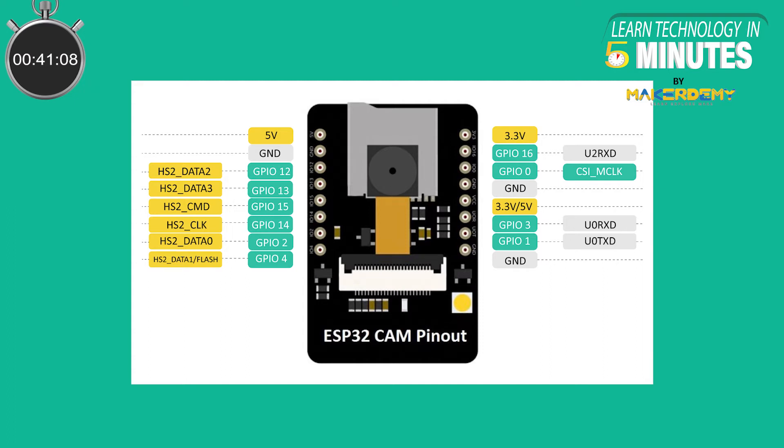Now let's examine the ESP32 Cam board. First, let's take a look at the side of the ESP32 Cam which has the camera module. If you have already had experience with other ESP32 boards, the first thing that will stick out about this module is the fewer I/O pins. To be precise, we only have access to 10 GPIO pins. Another thing you will note is the square LED on the bottom of the module, which can act as a flash for illuminating the subject you are trying to view with the camera. You can see that there is a camera connector onto which the 2-megapixel camera is attached, also known as an FPC connector.